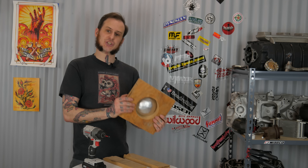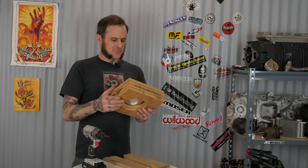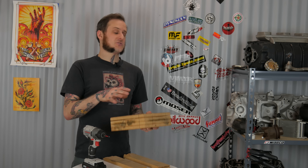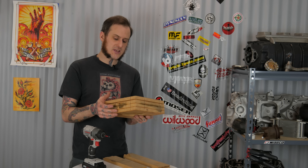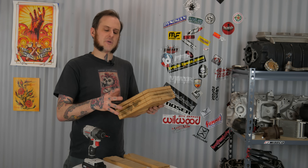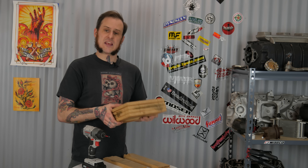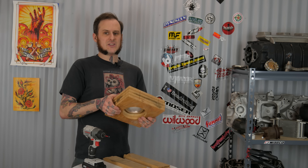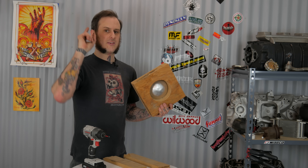I do have a little tear — I went too far with this. I was aiming to create a really deep dish to show you what you can do with this. I should have annealed this piece before I started, and I probably shouldn't have domed it as much as I did. I'm going to try and finish this part off anyway. If you get a tear like that the material is getting a little thin, but you might be able to finish it and weld that section back up. More than likely I would scrap this piece and make another one.